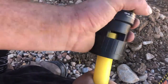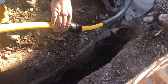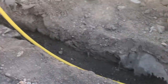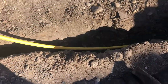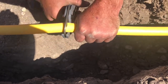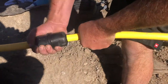We've got three-quarter inch pipe and we are honing out the inside with our special tool. We're going to put a little bit of lube and these fittings just slide right together. This is the riser — it's a metal piece that fits together and is threaded to three-quarter pipe. You just lay all that pipe down inside from one end to the other, lay the riser next to where you want it, give it a mark, cut it, and do the same honing and lubing process.